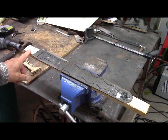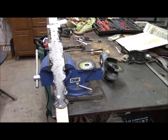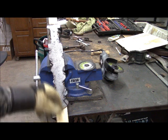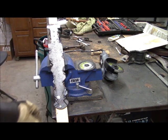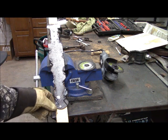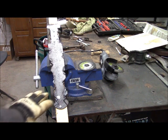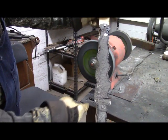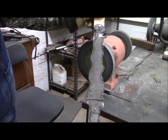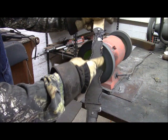Now I have the blade on the backing board and I'm going to use a small angle grinder and start cutting away the excess material. You can see the rather large number of jagged cuts I've made. The idea is of course not to cut your trim line. You wouldn't dare put this directly on your sanding belts because it would literally eat them alive.